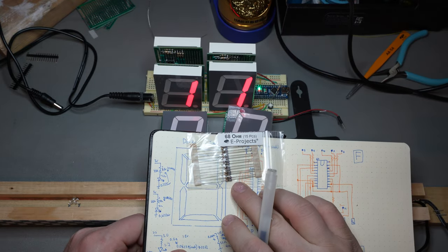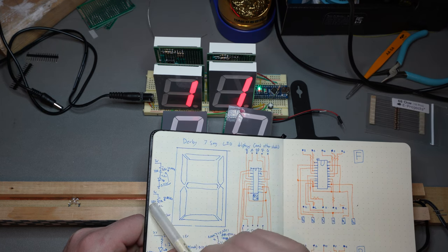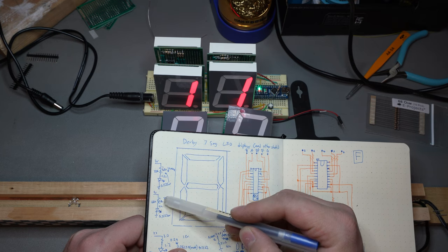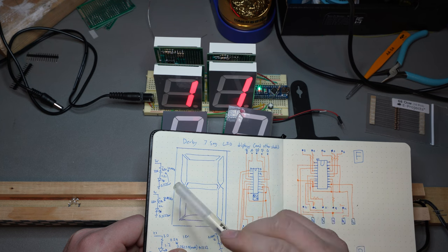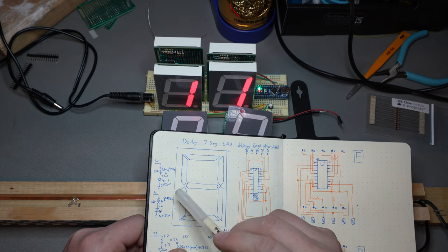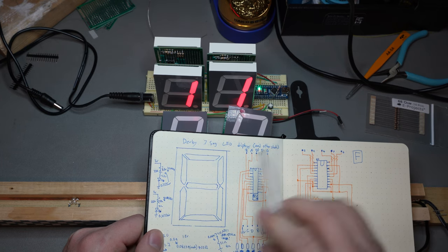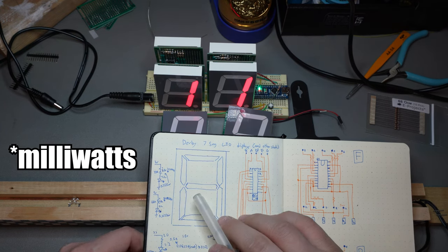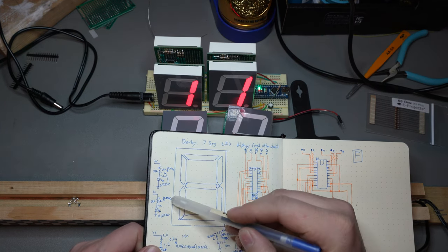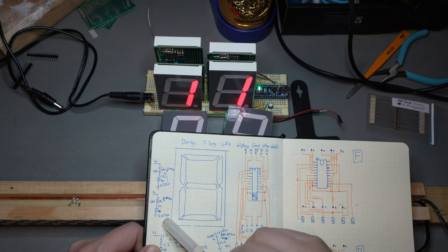So these are quarter watt, which means they can do 250 milliwatts of heat dissipation on there. And if we put in 68 ohms, now at 5 volts, we'll have 3.8 volts seen across that resistor, which puts our current at 55 milliamps, which puts our whole new system, these resistors will be dissipating 212 milliwatts, which is under 250 milliwatts. We'll be cutting down the current a little bit. The resistors are gonna be dissipating almost twice as much heat, but they should be just fine.